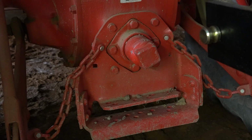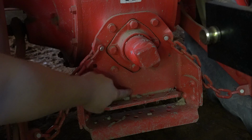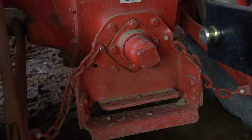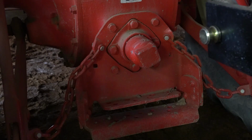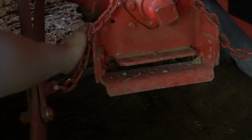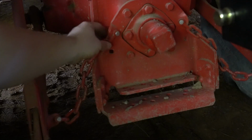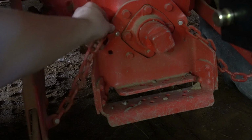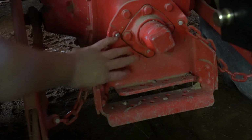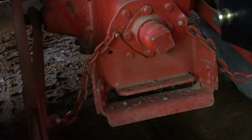And here's the 861 drawbar bracket. As you can see, this distance here is way larger. Of course, this one's dirty, you know, because these tractors get used. But you can surely tell the difference there. You can't really see it too much, but if you notice back here, there is no hook for the check chain. The check chain instead attaches way up top here. And the bracket only 4000 has this cut out and everything, because like I say, this upper section here is the same for the 600 models. Just the bottom is riveted on different for the row crop.